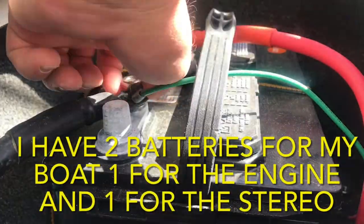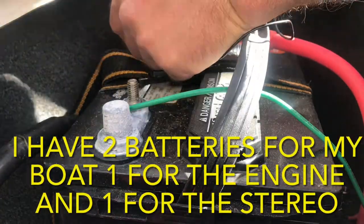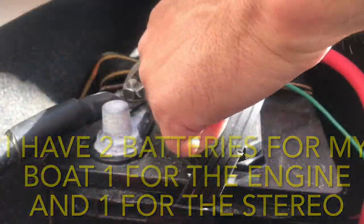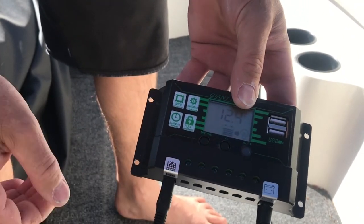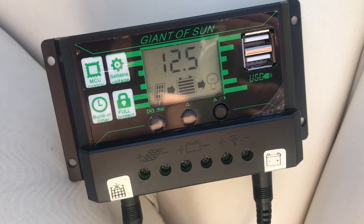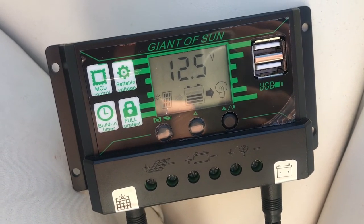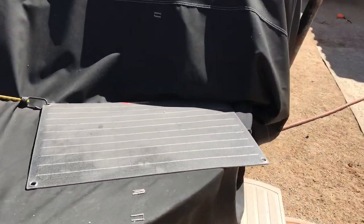For my boat, I purchased two 30-watt solar panels that came with controllers — about 40 bucks apiece — and I like these better than any of the other ones I got. I disconnected the battery positive and negative and hooked the battery leads up with a quick disconnect. Since this solar panel had a controller, you plug in the pigtail off the battery and the pigtail off the solar panel — clearly labeled with pictures. You can see right here that the solar panel is charging the battery. I used a couple of bungee cords between the two solar panels and down to the frame of the boat to hold them in position.